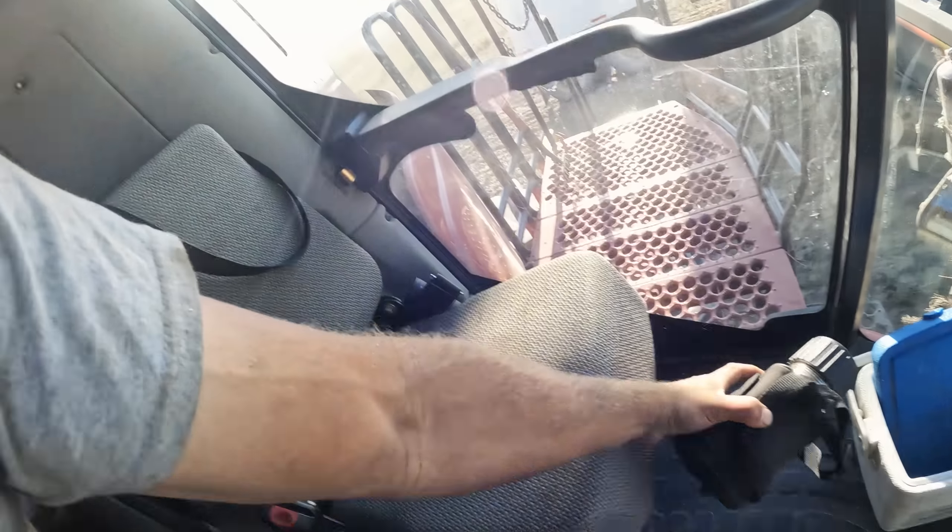Let's get her going. I've got about 15 acres harvested in the winter wheat and we've got about 1,500 to go. Let's do a moisture check. This is a portable moisture sensor — it'll give me a very accurate reading and I can use this to calibrate the combine's moisture sensor so it's in tune. I haven't calibrated this combine since we got out of peas, so let's go get some samples and find out.